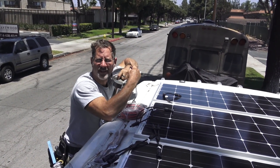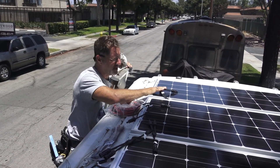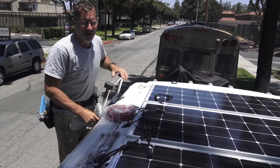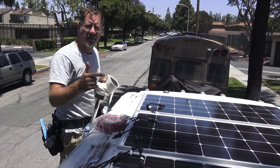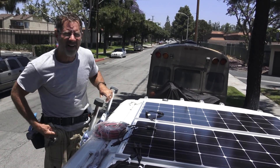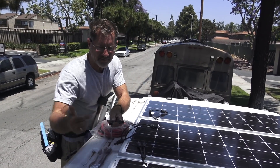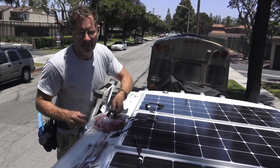What we've got is four 100-watt panels on the top with Z brackets. We've moved our Z brackets over so they hit a good spot on the roof for a solid mount, and now we're tying all these panels in. We can do it in series or in parallel — we're going to do it in parallel so the voltages stay the same. These are 12-volt panels running about 5½ amps each; the amps will be additive, putting us somewhere around 25 amps total. We take these Y connectors and go positive to positive to positive all the way down, same with the negative.